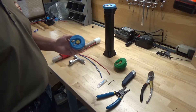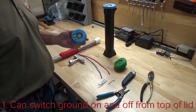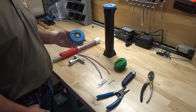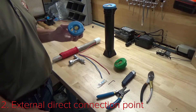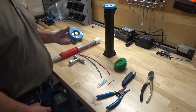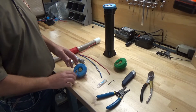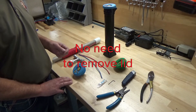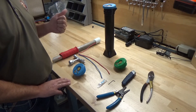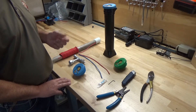There are two main benefits of this lid. The first is the locate operator can switch the ground on or off from the top of the lid at the tracer wire dead ends. Second, it provides an external direct connection point to tracer wire that corresponds to the utility they're trying to locate. That means the locate operator doesn't need to remove the lid from the base to connect or disconnect wires. That makes the locator's job a lot easier and, most importantly, it allows for a more accurate and more efficient locate.